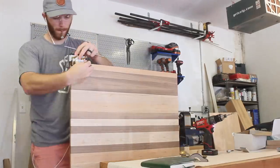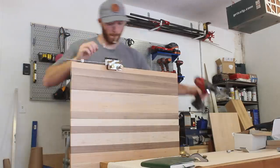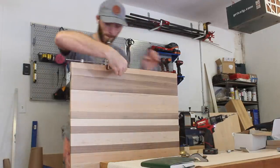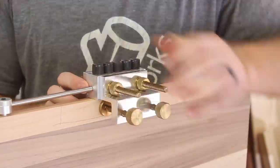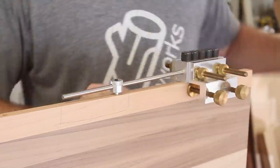In this case I cut the ends off before the sides, and this means I need to glue the sides back on before the ends. I used dowels to align everything nicely, and while that was drying I worked on the end piece handles.